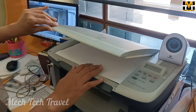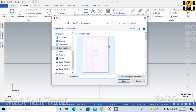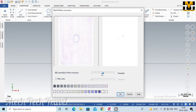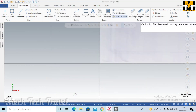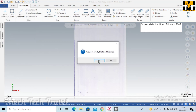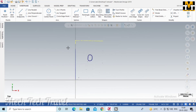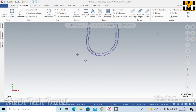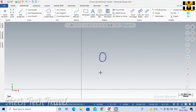This is the scanner. We will scan the JPEG file and open the Mastercam file using the Raster-to-Vector DLL tool. We will open Mastercam X5. We will give the exact line quality, scan the DPI, and set the same line. We will exit the Raster to Vector tool and delete unnecessary lines to keep the image clean.